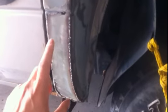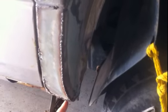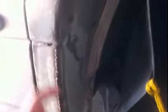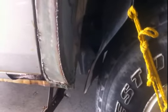Then I made and tacked the outside skin on, and welded that along this outside edge here, across the bottom and across the top. I got a little thin right here, so I do have a few holes that I might be addressing today with the welder. If not, we're just going to dura-glass over those. Then I proceeded to make the inside lip and welded that along this outside corner. So that was my first fabricated patch.